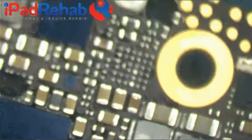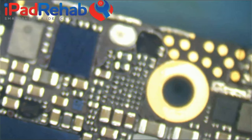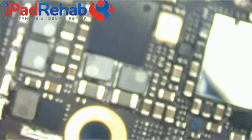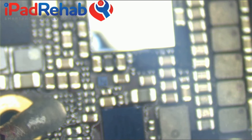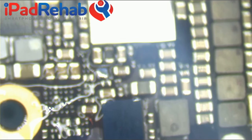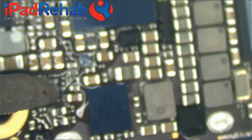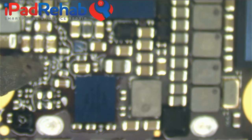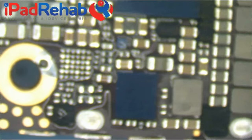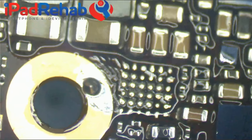All right, and when you do a 5S TriStar, you want to stay away from blowing your heat towards the audio IC. That's the only thing that is underfilled in this area. All right, let's get those solder balls cleaned up. Should we wick these? Let's think about it. Nope, let's not. Let's squirt a little bit of Amtec flux on here and get this sucker mopped up. Alrighty. Easy. No reason to ever pull pads on your 5S TriStar job. And that is good enough to go.